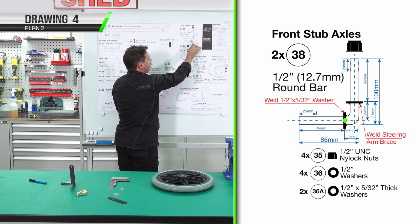This is part number 45 that we've previously laser cut. That's ready to fold. This one we've cut the template out of the plans. It's 1:1 scale. We can then center punch our holes to be elongated. You mark the outside, cut with a cut-off disc on a grinder, then we fold. The drilling will go 4mm, then 11mm. We've cut out our bracket.